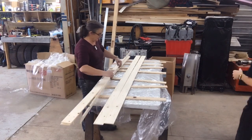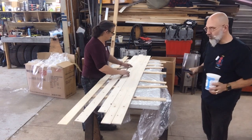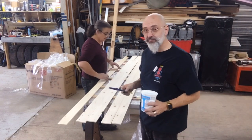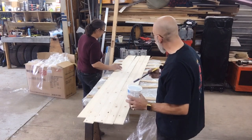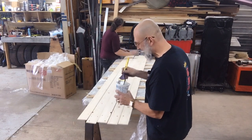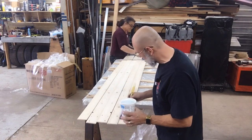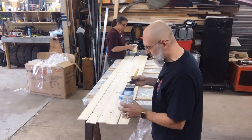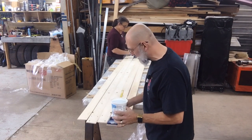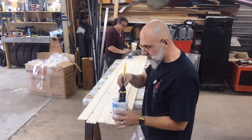So if we don't varnish both sides, we end up with wood that has the possibility of warping. In French, we said faire la banane, which is doing the banana. By having it sealed on the backside, it's going to allow us to put it up and not have to worry about slight variations in humidity, because we tend to go everywhere.